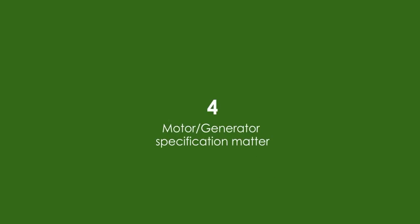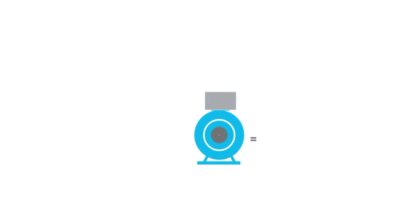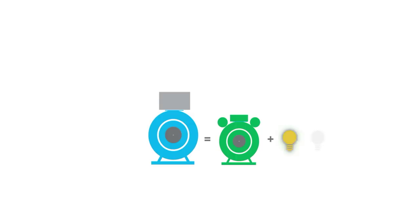Point number 4: The alternator must normally be able to withstand the load of the drive motor, plus any additional load intended. Use a 5 kW alternator with a 2 horsepower motor, for example. Similarly, use a 7 kW alternator with a 3 horsepower motor for best results.